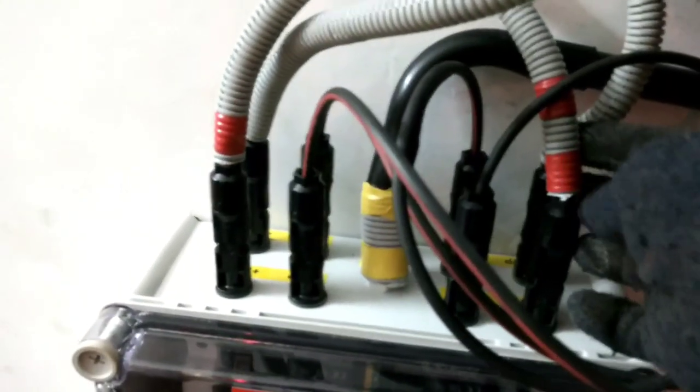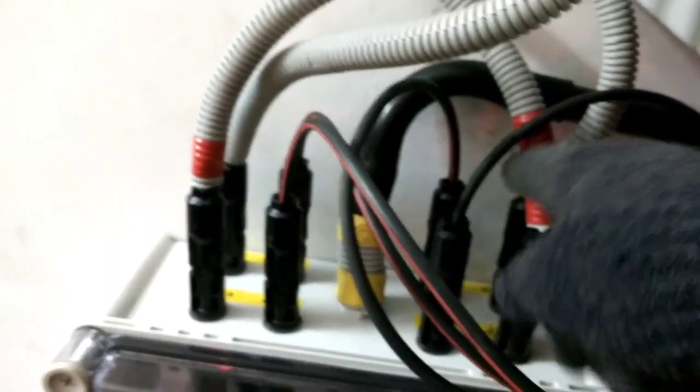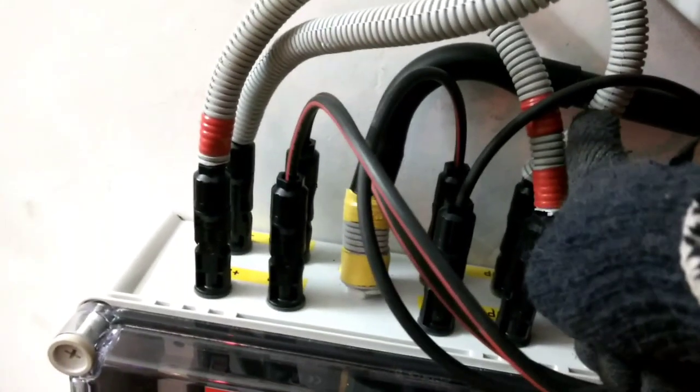The panels are all mounted. The DC wire comes inside the building, and we have properly mounted the conduit pipe with plastic clamps. Here the four DC wires are going inside the DC DB. You can see the positive and negative wires — I have labeled them with red tape: one tape for the first array, two red tapes for the second array.